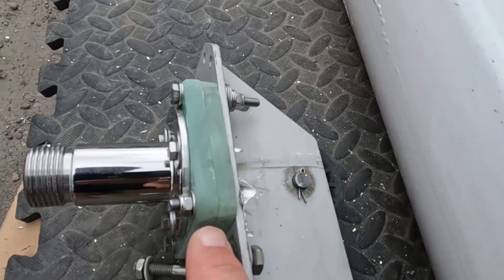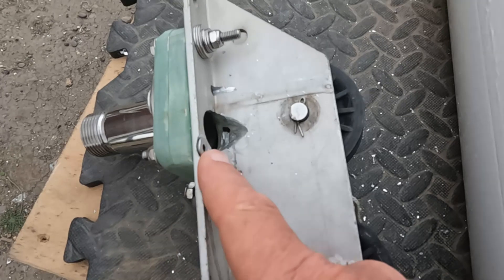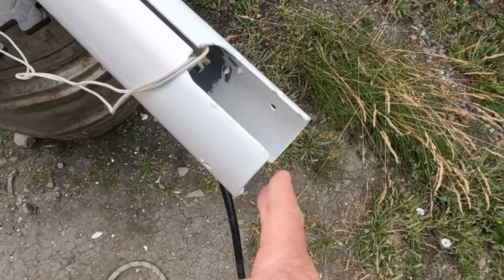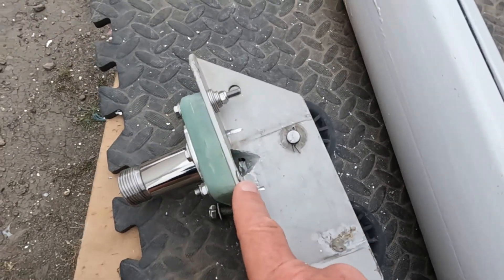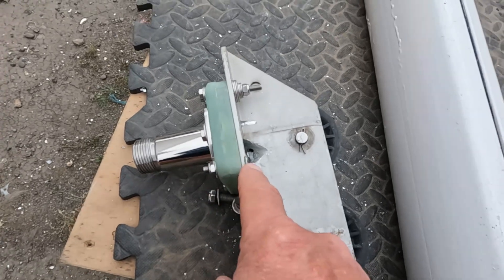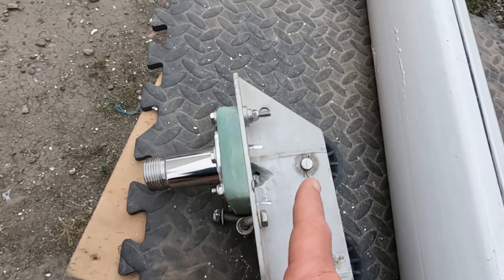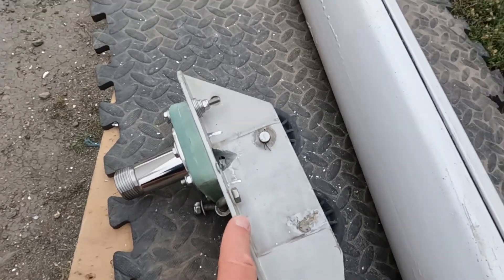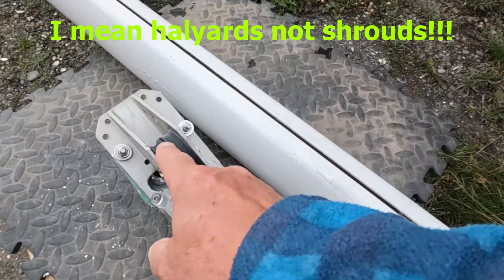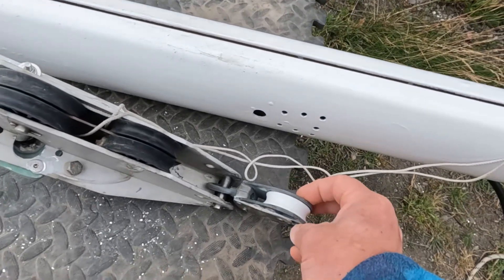The bolts look a little bit weird. I had to do this one kind of upside down — a countersunk head — because of the way they hit the sides of the top of the mast. They're all finished except I want to paint the FR4 and I need to put dielectric grease on all the bolts where they come through the aluminium. At the moment we only ever had two shrouds coming through the top of this even though there are four positions.